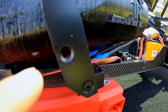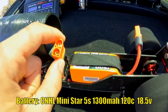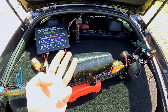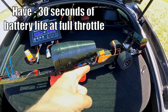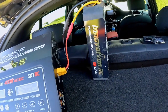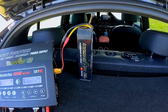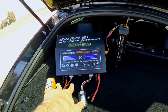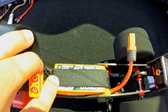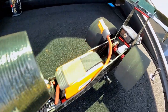From the ESC, motor wires lead to the EDF motor — that's all that it is. Right behind the ESC we have our little LiPo battery — a 5-cell. This EDF is really power demanding, so I'm only going to get about three or four good pulls before the ESC cuts off for low voltage. So we have two batteries. When this one dies, we charge the other via DC power with an Innovation RC 4S battery. This is a small 5S, 1,300 milliamp battery, and the Innovation RC batteries cap out at over 11,000 milliamps, so we could charge six or seven of these small batteries off one of those. The batteries snug perfectly in the rear with a little battery strap — perfectly stable.